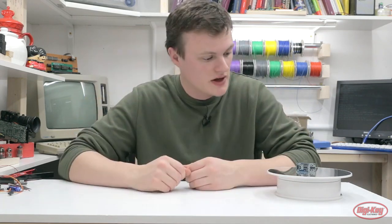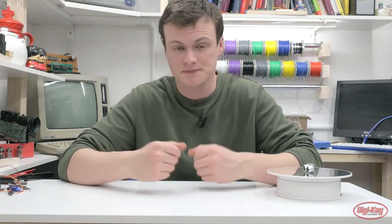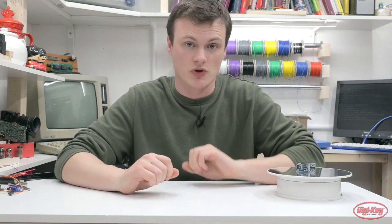But we also realized this comes with a few issues. The first is mechanical strength and strain — over time the antennas eventually weaken and become broken. Secondly, the feelers can touch objects which may transfer their charge to the feelers and damage the inputs, so you'd have to use ESD protection. And thirdly, the feelers actually require the robot to touch objects, which may not always be practical — which is where the ultrasonic module comes in.